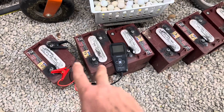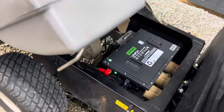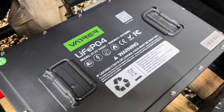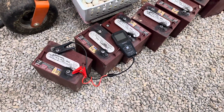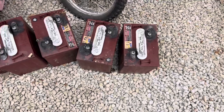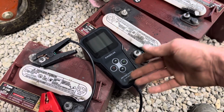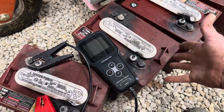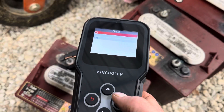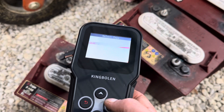I've got a whole stack of Trojan T105 six-volt batteries here that just came out of a Toro Workman — it had a Vader retrofit put in. Getting them charged up right now, but a couple of them are dragging down the entire system. I'm going to find out which are the bad Trojans and which are the good ones, and see if any are salvageable. For checking a big stack of lead-acids, a quick check like this is much better than just relying on voltage.